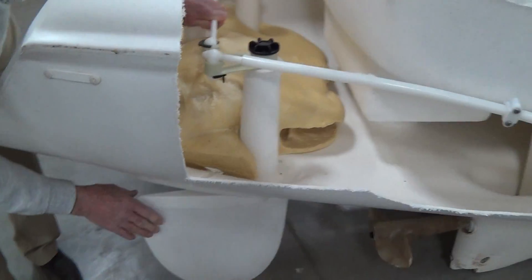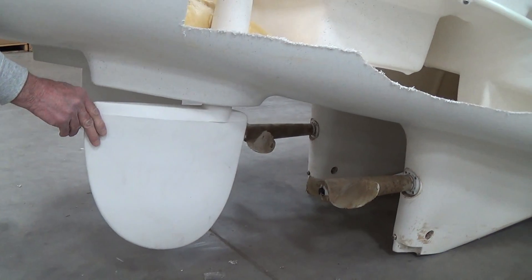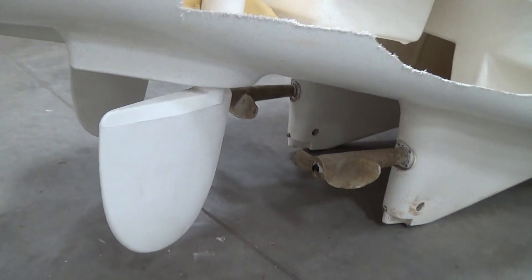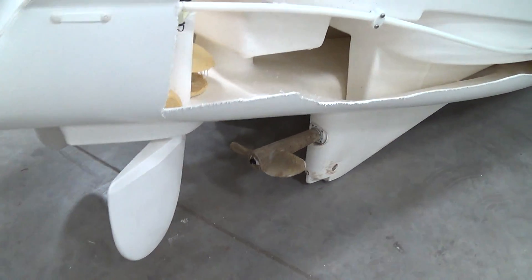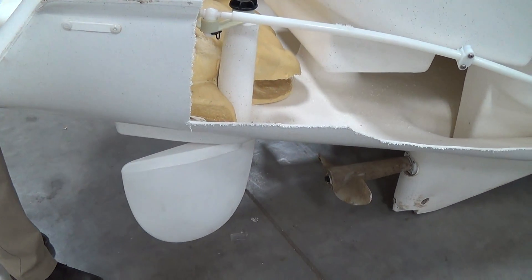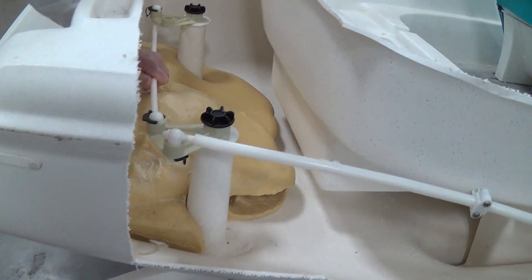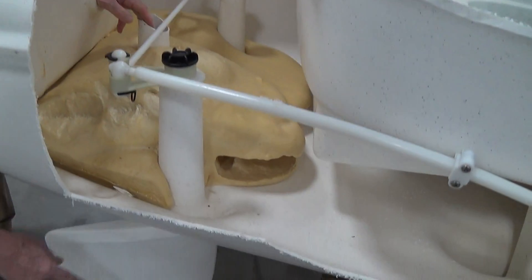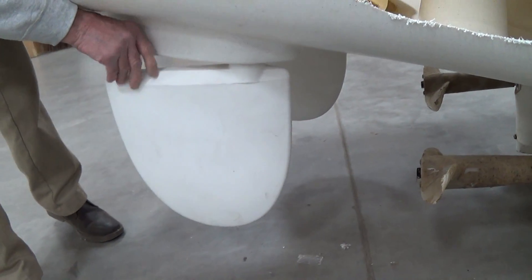You have to make sure that these rudders, when you put them up through, are in line with the boat. They can be off by 60 degrees because this is a hex connector on this delta. They can be off by any factor of 60 degrees — 60, 120, or 180 degrees. The rudder could be all the way around so that it's absolutely backwards.